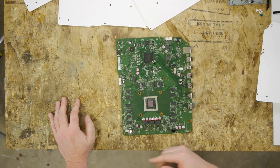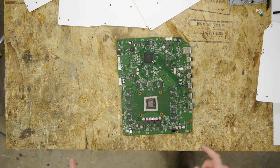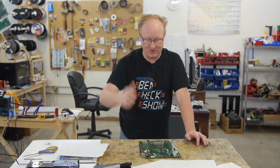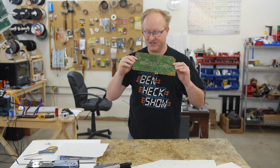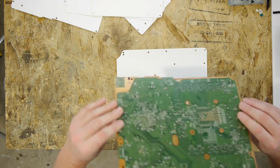This axis is accurate, but this axis will have a spherical distortion because of the way the lens compresses it, because the sensing element isn't this wide, it's actually like this wide, and then it's compressed, kind of like an anamorphic camera lens. So I took this into the computer and I lined up all the holes and I cross-referenced it with measurements of the actual device. Then I started cutting paper patterns with my laser.